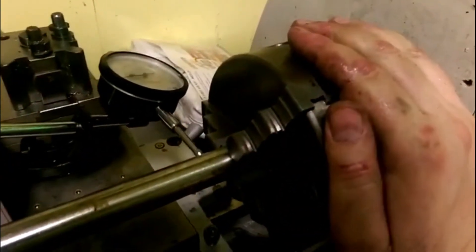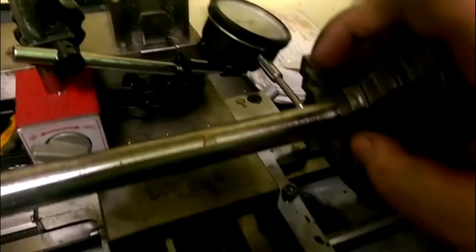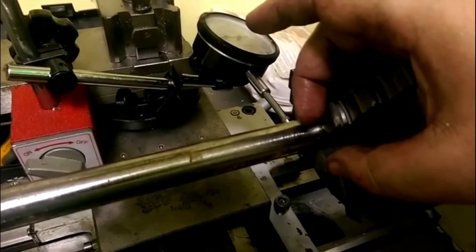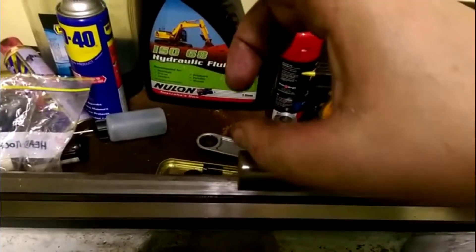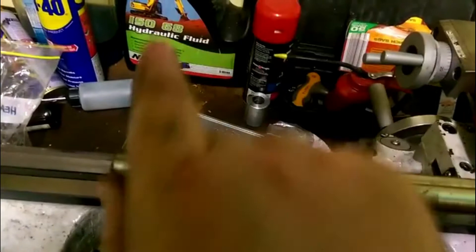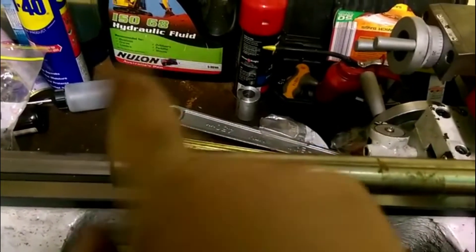Your chuck can have as much runout as you can stand. You take the average when the runout is high and low — you take the average of the two at the headstock, then move out to the tailstock end and take the average of the high and the low there. If this average is greater than that average, you know you need to bring the yaw back towards me. And if it's the other way around — if the average is pointing too far towards me — then you want to turn it the other way.